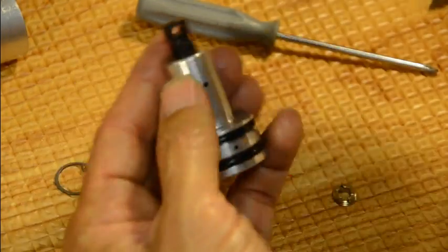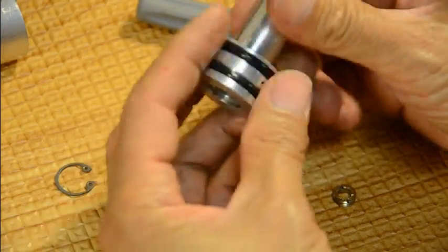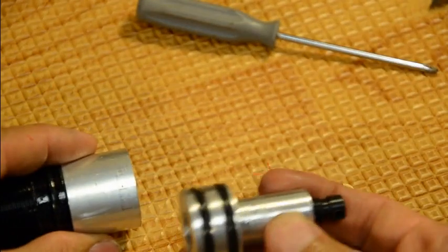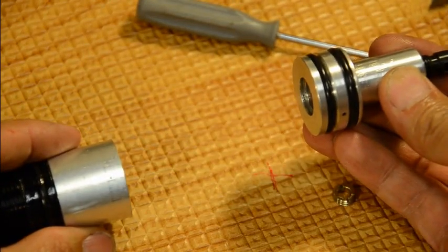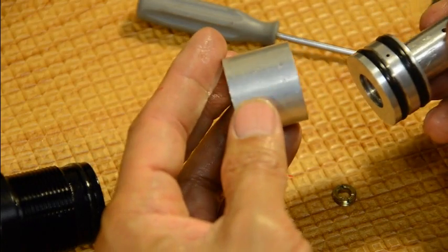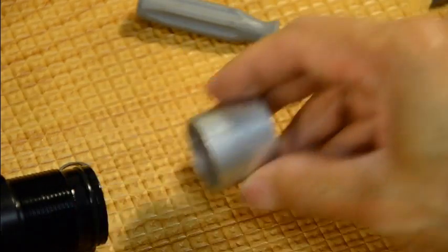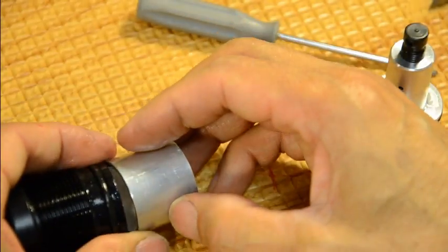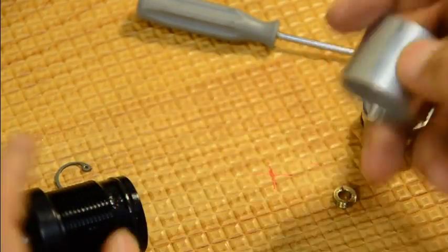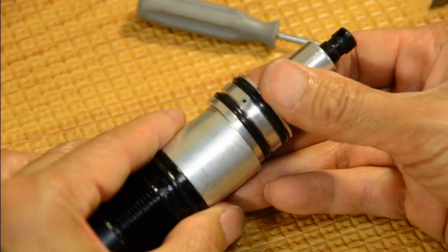Take it back down to the original setting and put it back in, then re-lube the o-ring. The spacer also goes in first into the tube. I did a mod on my .25 caliber — I put about eight more holes in the spacer to have more regulated volume area, since the .25 requires more volume. More regulated volume between the regulator and valve helped the consistency somewhat.